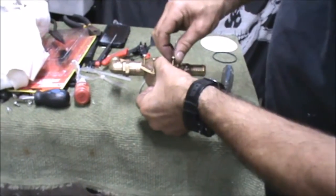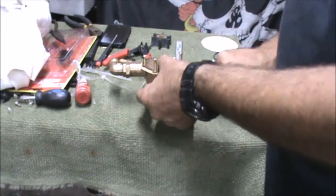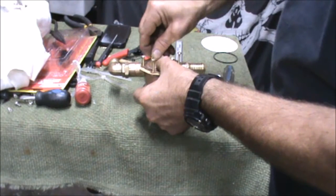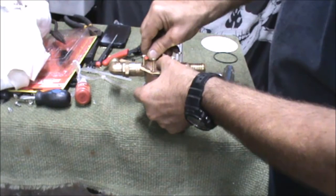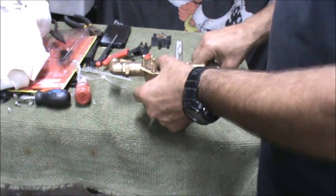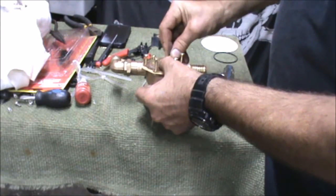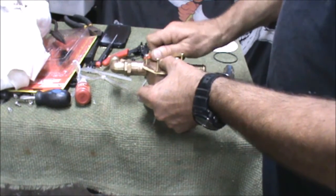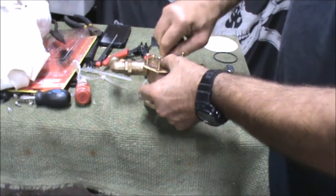So I'm just putting the gasket on and it's going on okay. Looks like it was made for it. There is a second pump like this that's got a round face, but it doesn't really matter because this will still do the job. As you can see I've spun the face plate around so that now the flattest surface I've got is on the inside, which is where it belongs. I'll just screw this down and that'll be us done, ready to put it back on the boat.